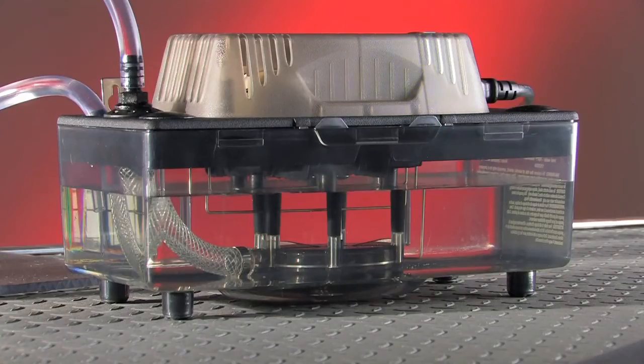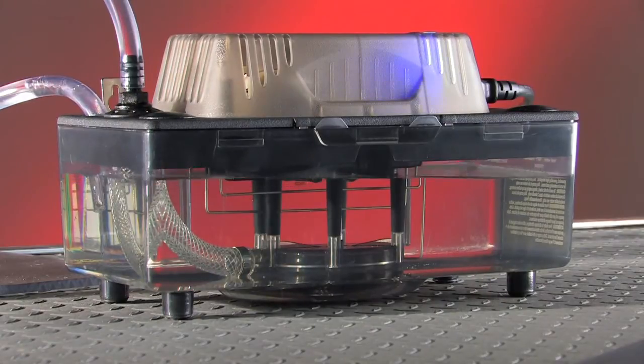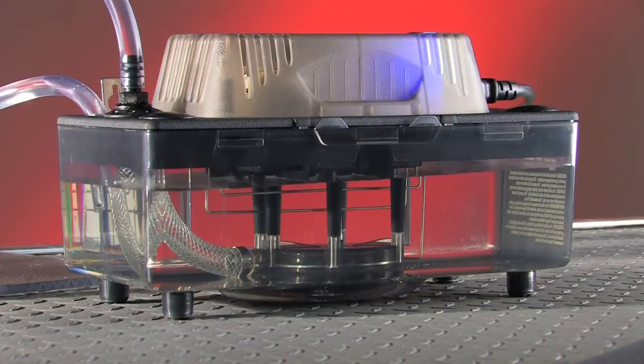You may wonder why that's key. As you can see, water is sloshing back and forth in the tank during a clog. If your pump has a mechanical float, it will bounce up and down as the water sloshes in the tank, turning that alarm signal off and on repeatedly. This will happen in any condensate pump with a mechanical float. This off-on alarm cycle will then short cycle your compressor, which we know can cause damage. Again, no float, no problems.